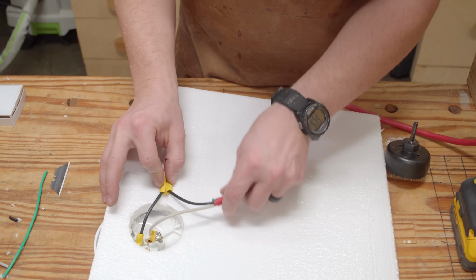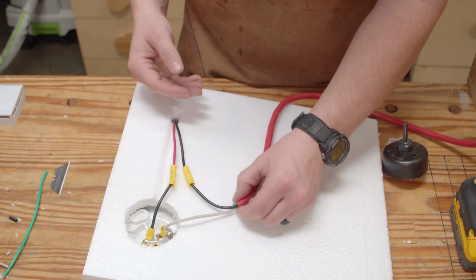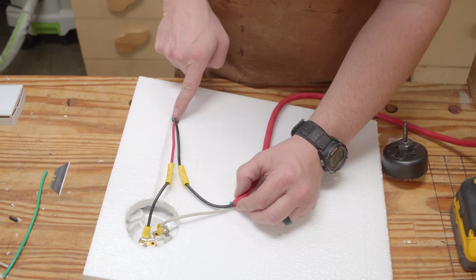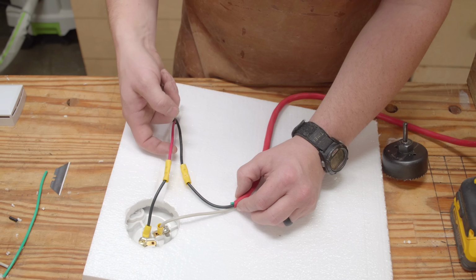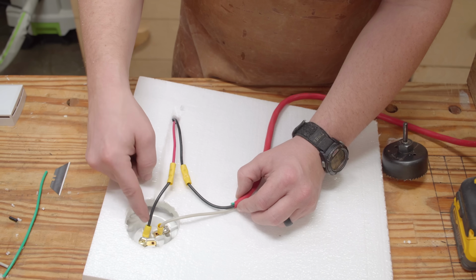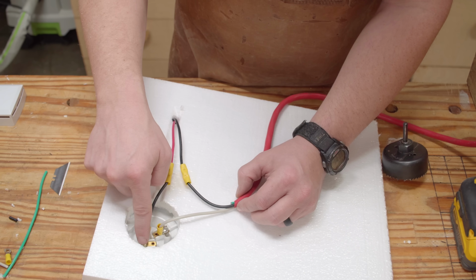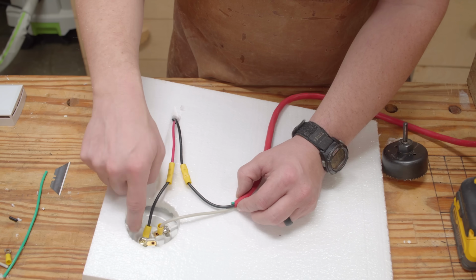I got to make this a little bit larger, like I said, but the power wire coming in, now we're not dealing with a ground here. These are two very simple devices that do not have a ground, so I'm not dealing with a ground. I have power coming in, going to the power or the load wire on the thermostat, which in turn puts power on this red wire coming out. I clipped off a little bit extra of this to attach right here to go from the red wire to this connection down here, and I use these little connectors here to bend this around and make this a little bit easier for me to connect. So I've got my hot connected here and my neutral connected here. So once the thermostat trips, it'll allow power to come through here, powering this.